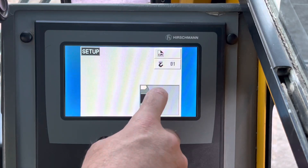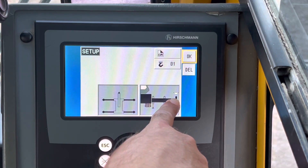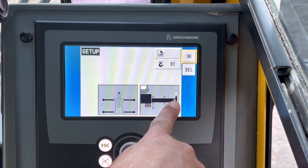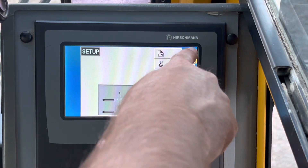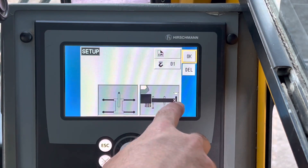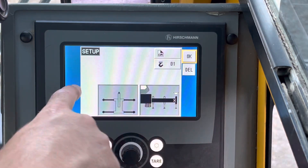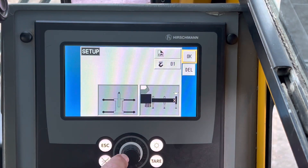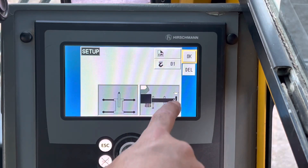I'm going to be on outriggers. You'll notice there's no yellow indication on that last outrigger — the system is automatically detecting that the outrigger is out. So if your outriggers are already out, don't highlight it, just press OK. If you try to press delete and have the yellow highlight over it, it's going to show a red X on your LMI and make the system freak out. If your outriggers are already out and you see that white symbol, just press OK.